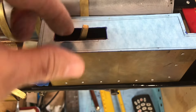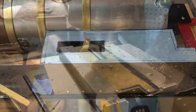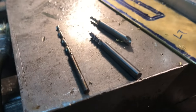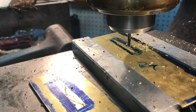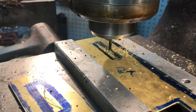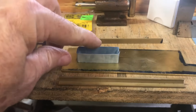After making the tank tops and fastening them down, I'll be able to accurately locate exactly where I want the pump to go — I can move it back and forth about a half inch. Once the top is fastened down I'll know exactly where the pump can go, mark the holes, and drill the mounting holes. For cutting out the center holes, I drilled with an eighth-inch drill in all four corners, then used an end mill to very slowly and carefully cut out the brass for a nice clean slot — minimal filing involved.